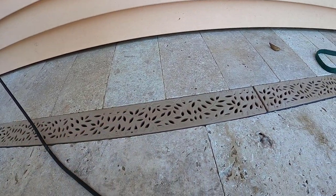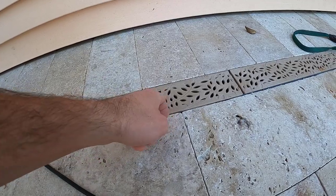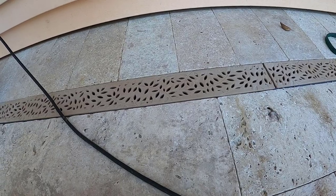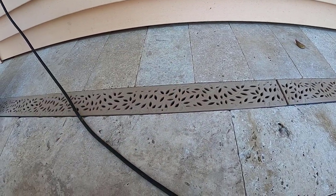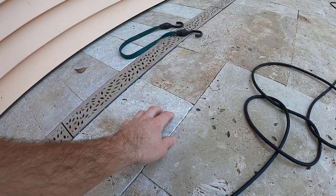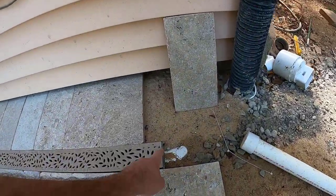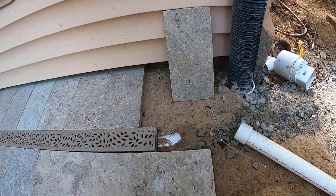The final step is using polymeric locking sand on these travertine pavers. I'm hoping I establish enough buildup between the edge of the tiles and the drain cover so water runs over into the channel drain rather than between the two. For heavy rain it'll just wash right in, but with a little bit of water there's a chance it could drop in between. Good thing about dry-setting the tiles — I can always adjust them. I'll come back and reset some areas before locking them in place with the polymeric sand.